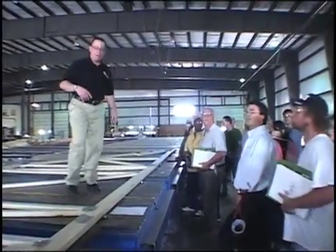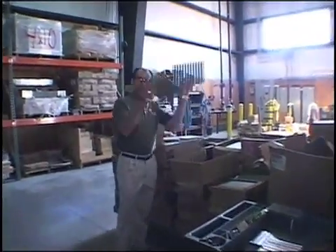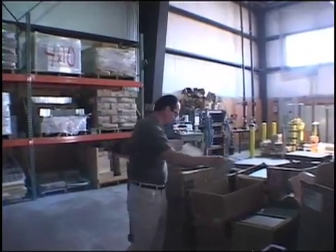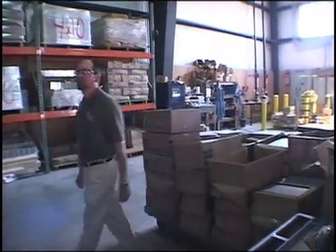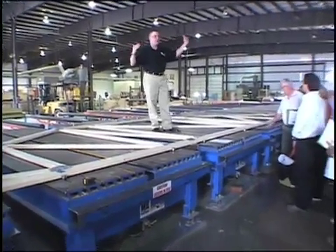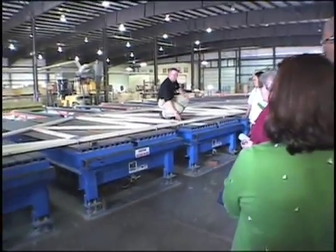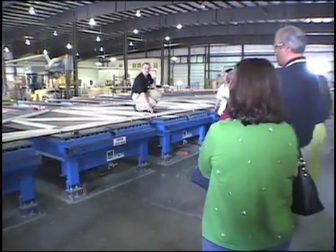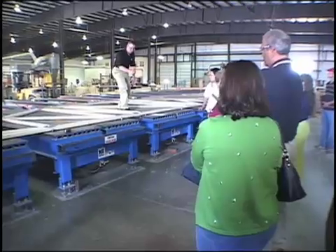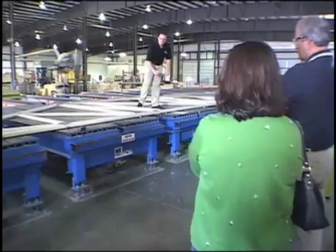The lights tell them exactly what size the material is and where it's going to go. That includes these truss plates — you'll notice in these boxes the truss plates come in all different shapes and sizes, all predetermined by our product design team depending on wind load and snow load for where we're shipping the truss. Because we ship from Michigan to Massachusetts, the same truss going to different areas requires different wind and snow loads.